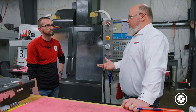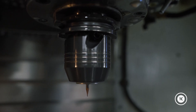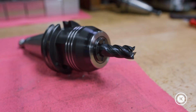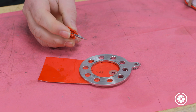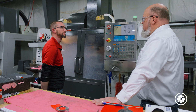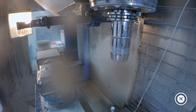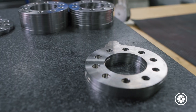With our in-house coating capabilities, we can actually tailor those in the chamber to make sure we get less coating on a micro wedge, so you're not rounding the edge over. To keep the end mill sharp — if you have a tight tolerance on a larger tool, it becomes even more imperative when you shrink that down to 10% of what you originally started. The tolerances become closer, the fallout in manufacturing becomes greater. Smaller tools, the detail that goes into them — they take a little longer to run than a bigger tool. So after our rough pass, it's going to come in and check to make sure that that tool isn't broke. We haven't had it stop on it yet, so that's a good sign, before it'll bring in our finisher. That was one of the biggest problems before — it was breaking our other tooling and it would run the whole cycle, and you'd end up with a scrapped part in the end.